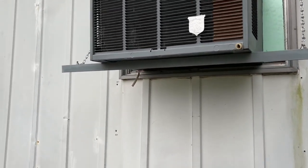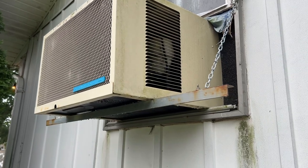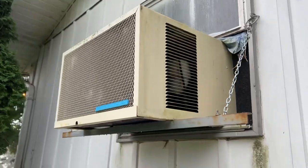That one didn't even run — I remembered to turn that one off. I figured I'd leave this one on for backup because I came back out, but I never came back out. It's got a little bit of frost on the side of the compressor but the suction line is not frozen up — that's crazy.